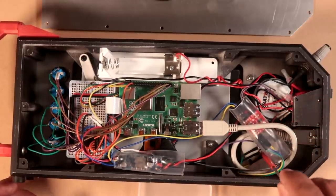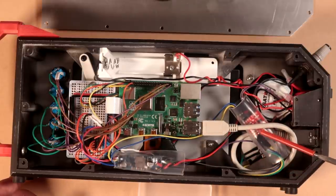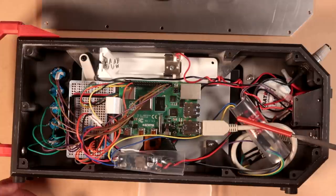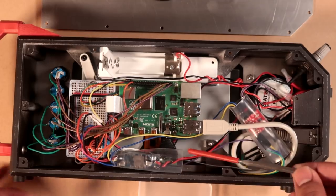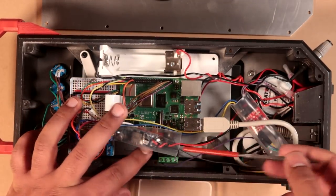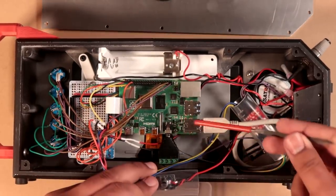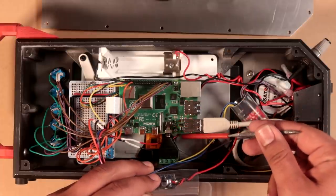The potentiometer is connected directly to the audio amplifier. And this is a mono amplifier, so I've only got one speaker and this connects to the left channel of the Raspberry Pi. One thing to note, a little quirk of the Raspberry Pi, it's a little bit tricky to see. So I've got this tip ring sleeve